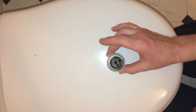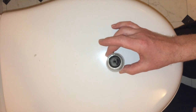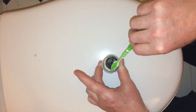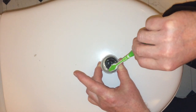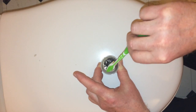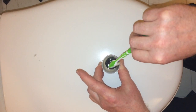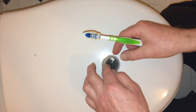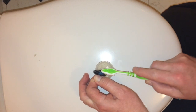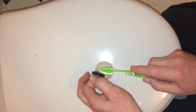What you can do is agitate it a little bit, and you'll begin to see bits of scale just falling off. As I do that, it's coming off in quite big pieces. And when it's been soaking in there a few minutes, you can take a used toothbrush and just gently brush away at the edges of it and get as much of it off as you can. You see already it's pretty much loose, and then also turn it over and do exactly the same on the back. As you can see, it's all just coming away in my hand, and this is only vinegar, so it's completely harmless. Go around the edges, and then what you want to do is to rinse that under some cold water and just make sure you've got the rest of the scale off.